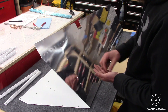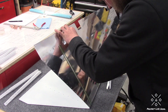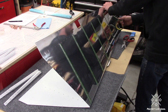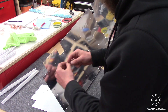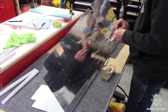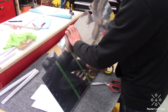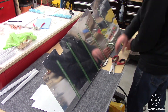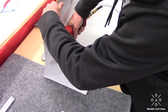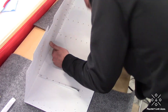After completing the dimpling and priming operations I went ahead and started adding in the rivets and then taped them on, since this will be a back rivet operation for those stiffeners. I usually try to do all of my similar operations in one batch — so I placed all the rivets in all the holes and then came back and did the taping. A couple of times that did not work out in my favor; I would catch an edge of the elevator skin and a bunch of rivets would pop out. The elevator skins are a little bit flimsier, not as stiff, so they do have a tendency to bounce and wobble quite a bit. Also, I would not recommend placing rivets and taping them in on both sides — those rivets on the skin side you're not working on do have a tendency to get in your way.